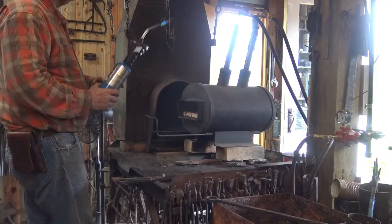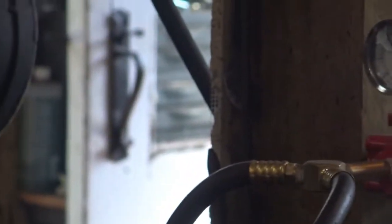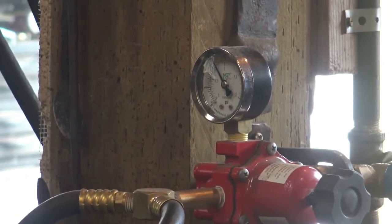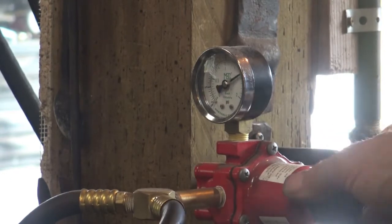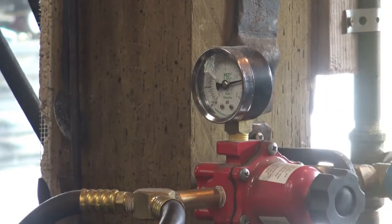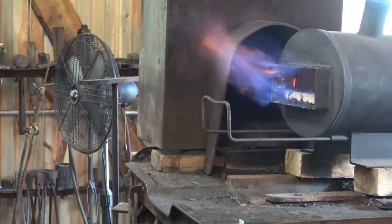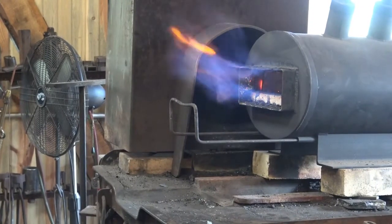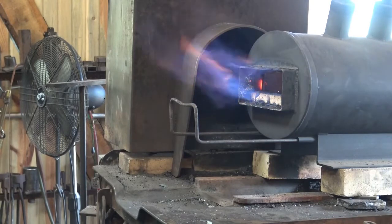This is the easiest way to light a forge I can make. This forge likes a lot of gas pressure to weld, so we're going to turn this up to about 18 pounds per square inch. Now we have to let it get hot — this is going to take about 20 minutes to get to welding temperature. I've got several other adzes I'm going to tack weld, grind, and get ready so I can weld five of them up in this small batch. I'll join you again when the forge is hot.